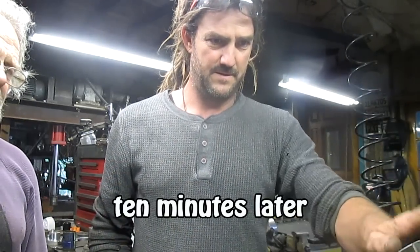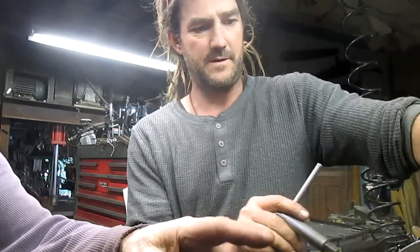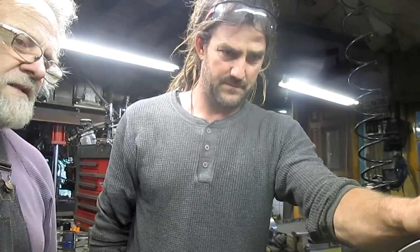You're pretty close now. High point. Okay, there's your high point. You probably don't want to loosen it because you're within ten thousandths. Just try to tighten it. Yeah, it's probably good. Yeah, you're in ten thousandths now.